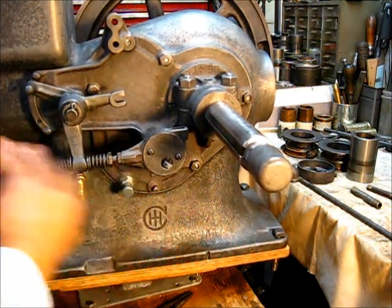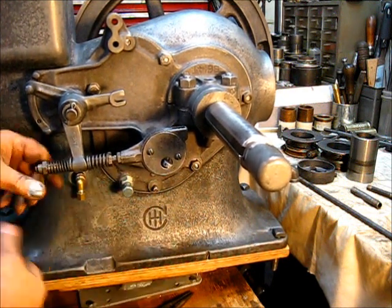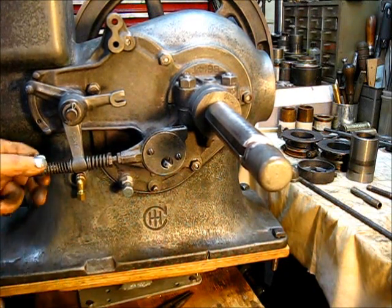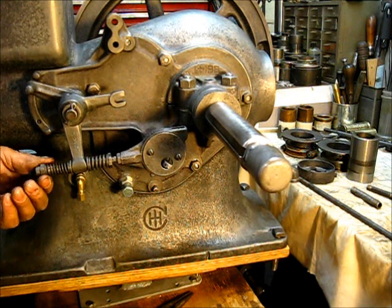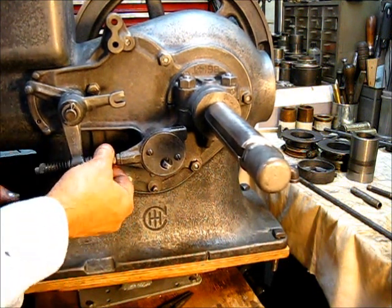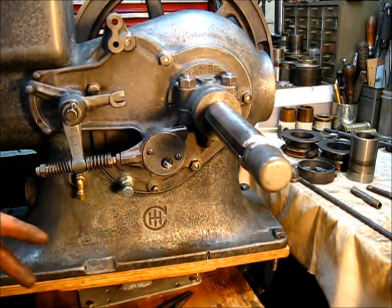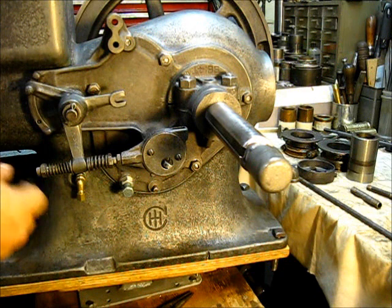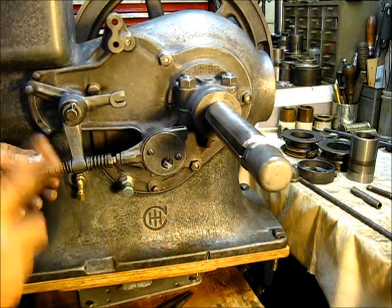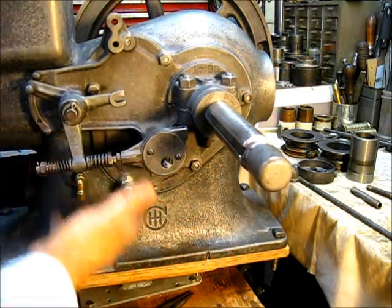There are enough adjustments on this thing right here. You'll find them where there will be a whole stack of washers in there, but there are enough washers on this system to where if you adjust everything correct, you will not have to put all them washers in there. Maybe there will be an occasional weak spring or something where you would do it. But when you do get it all adjusted, you would adjust it to where that cotter hole in the front right here is straight up and down so that you can put the cotter right like that. That's just good workmanship.